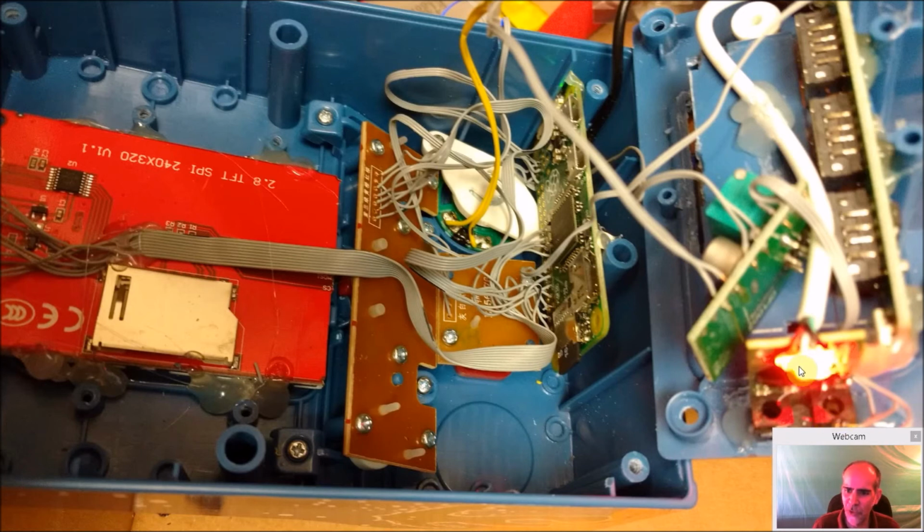This LED is very, very bright. I left it on. You can see it more in the Yellow Pac-Man than the Space Invaders because it's darker. If you don't like that light, just hit it with the soldering iron, pop off the LED, or move it somewhere else. You know, maybe you want it somewhere else. And I may actually do that with this and the power on the Adafruit, because if you look in some of the holes, you can kind of see what light's going off. But I did not actually move the LEDs to a probably better location. So I might go back and do that on these, or leave these alone. On my next build, I may do that.